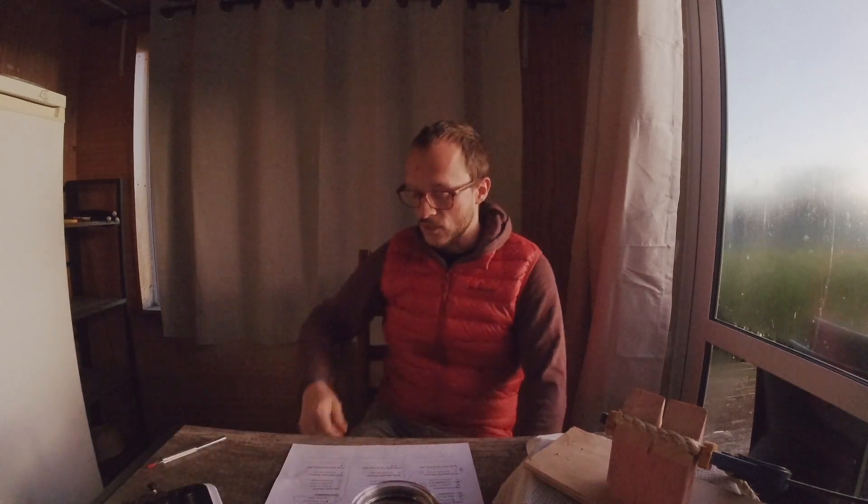So this is my final fine edge. I've tested a lot of fine edges that have performed well. Today I'm going to do one that was honed down to 0.1 micron lapping film. Now, lapping film in my experience leaves a really aggressive edge. I've seen research on the Science of Sharp website where he shows that lapping film can often leave a little foil burr, which is detrimental to edge retention, so I was really careful with this one.